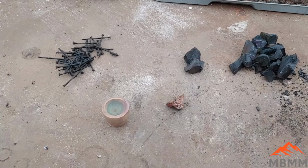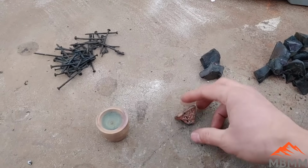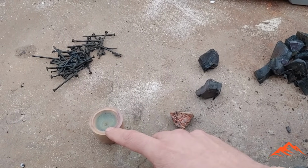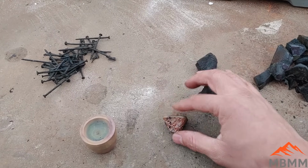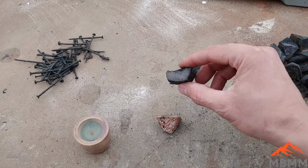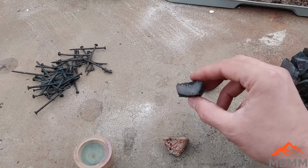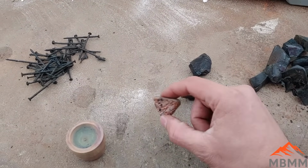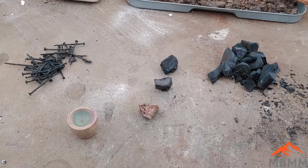This was a good experiment. I think it was worth trying, but I think in the long run, or if you're going to scale up, this probably isn't a good way to proceed for a couple reasons. One, it doesn't really do you any good to get out the precious metals. If you're going to process this by electrowinning, you're going to do it anyway, so there's no reason to do an extra step or two just to get the precious metals out earlier. And using the iron reduction method, we still have some base metals in here, probably quite a bit of copper that we can't recover, and that's a lot of value of our stuff. So it was a good experiment, but I don't think this is the way to go in the future.